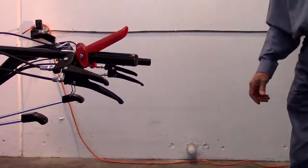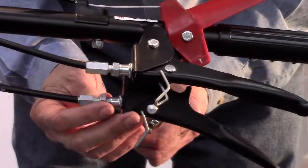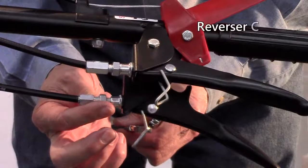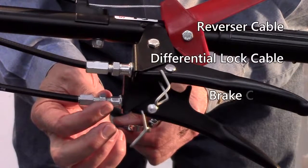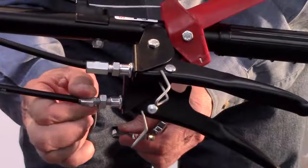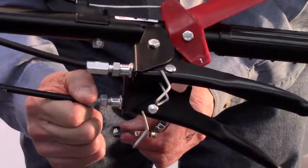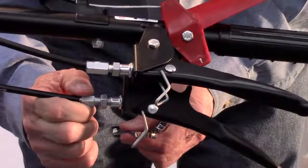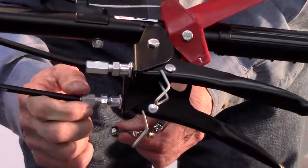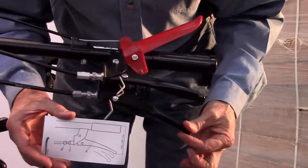On the PowerSafe models, if the clutch is performing properly, we do not recommend adjusting the clutch cable. In similar fashion, adjust if necessary the reverser cable, differential lock cable, brake cable, and handlebar offset cable. In each case, shorten the cable by turning the adjusting tube counterclockwise and lengthen it — which is to say increase the free play in the bottom arc of the lever — by turning the tube clockwise. Test repeatedly until each function is performing properly and, in each case, be sure to retain some free play in the lever before you feel resistance.